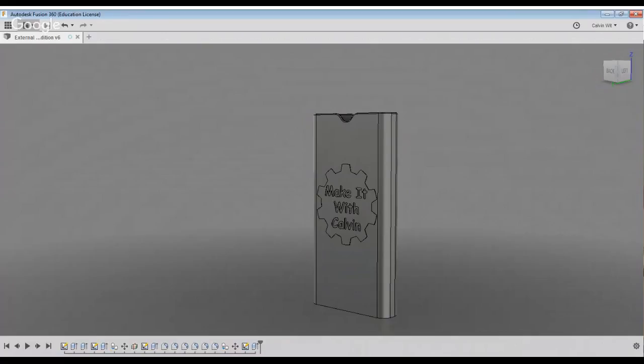And the print time on this, let me turn off the raft because I'm not going to be printing it with a raft. Yeah, the print time on this is about a 5-hour long print because this is going to be done in NGen Flex, so I can't run it very quickly, or I will run into quite a few print quality issues, which obviously I don't want. So I'm trying to minimize my crossing-the-middle movements, but there's only so much you can do.